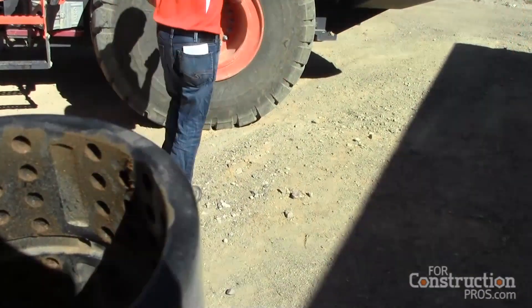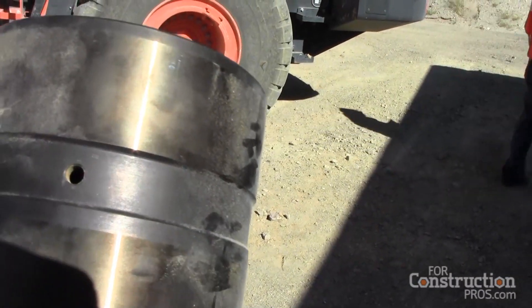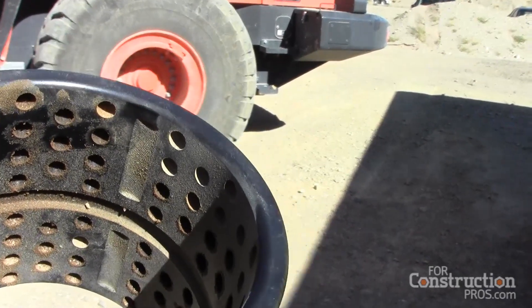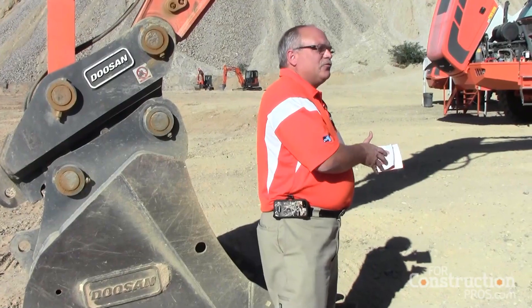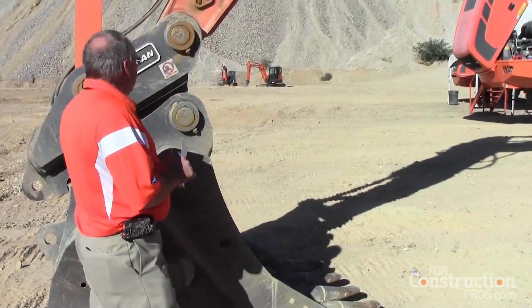It's a bushing — if you look at a golf ball, it's got little dimples in it, and that's kind of like this bushing. It's got dimples in it, and the benefit is it holds the grease and the debris. Any debris will just go into those little dimples, plus the grease will stay in there longer. We still recommend the usual service, but there's been an improvement — you can grease a little less often and it doesn't hurt it.